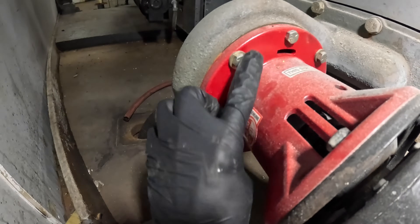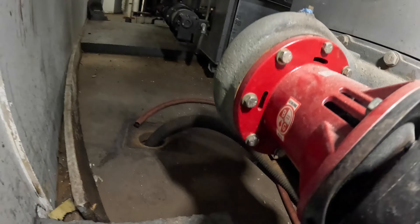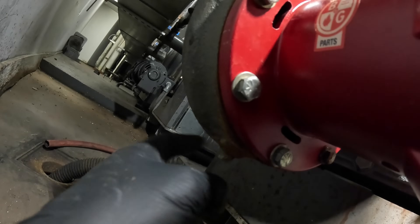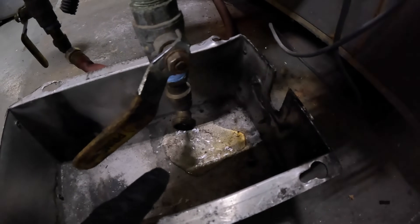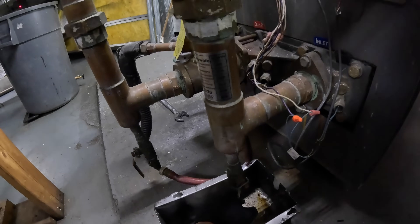Here we have all these bolts — behind here is a gasket, this is the motor, this is the pump. The coupling puts it together — pump motor assembly. There is a little drain plug here that might be smart to pull out first. If we loosen this up we'll drain it out. We only need some air to push it before we pull this whole thing out. Let's crack this open a little bit to push some air through — and now we got water passing through.